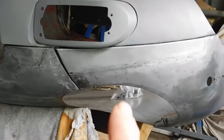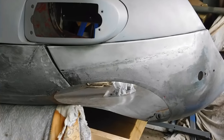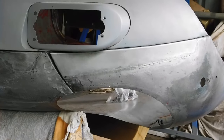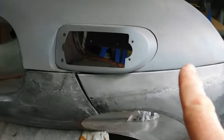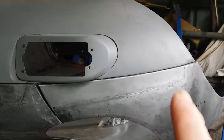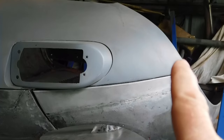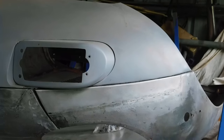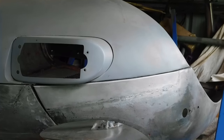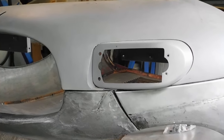At this stage this is cleaned up enough. There's still more repairs to do to this guard and actually to both guards. The next step is to drill the holes, line this bottom panel up to make sure it's right, and once that's done adjust the fit at the end. I'm pretty sure this panel is short, so I have to add metal on the edge just in there. There will probably be a few other adjustments to the bottom panel, or maybe to the air ducts more than the bottom panel.